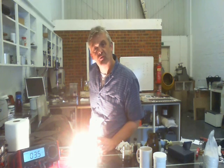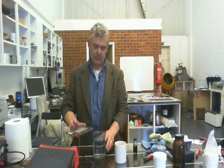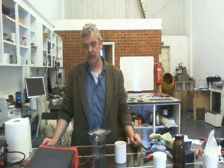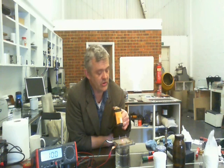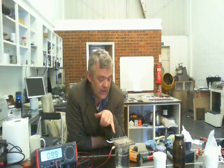Shining a light on it it looks about 3.6 milliamps. It's pretty cold actually here today — about 5 or 6 degrees centigrade — so I've heated up a beaker of water and I'm just going to put it on the beaker of water to see if warming it up has any effect. Temperature is 39.2 degrees and we're getting 10 milliwatts, which means per square metre it's about 325 milliwatts — so a third of a watt per square metre. Again not fantastic, but this is the first eutectic solvent we've tried and we've only tried one mix. I would say this looks pretty promising, because obviously you'd want to try different eutectic solvents with different concentrations and different amounts of ions. We're certainly getting some pretty impressive results.